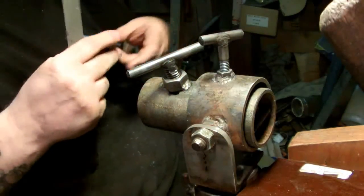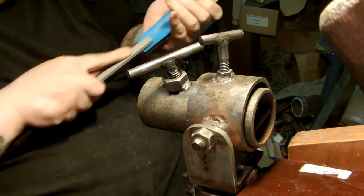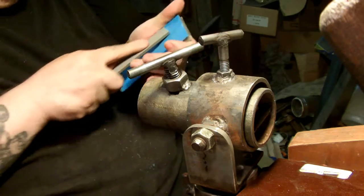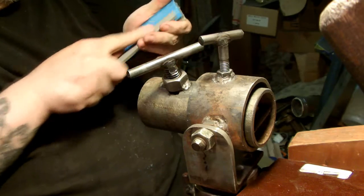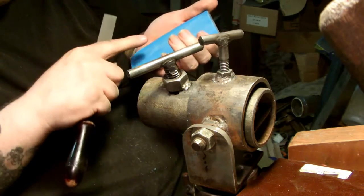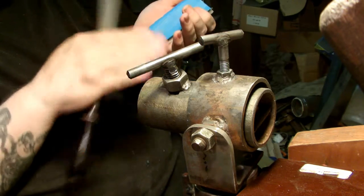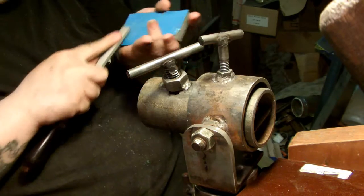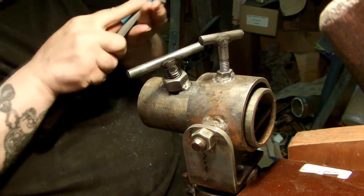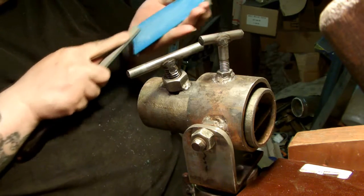Other one too. Also, the glue that fits into all these little crevices and hills and everything creates much more surface area than it does just plain flat. This almost like triples or quadruples the surface area, or even more sometimes, you know. It just creates a ton of surface area, so you get a lot more adhesion strength.